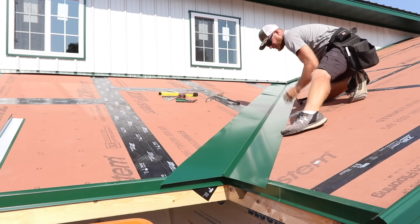Now it's time to work into that valley, but first we've got to snap some lines so we don't mistake our angle or pitch of the sheet. We're making a three-foot reference line to give us an exact place to get our angle for the steel. The angle is 43.9 degrees — that's been consistent throughout the entire project — and with mathematics I'm able to lay out where the edge of every sheet is going to hit that valley line, giving us reference lines for measuring our first sheet of steel.